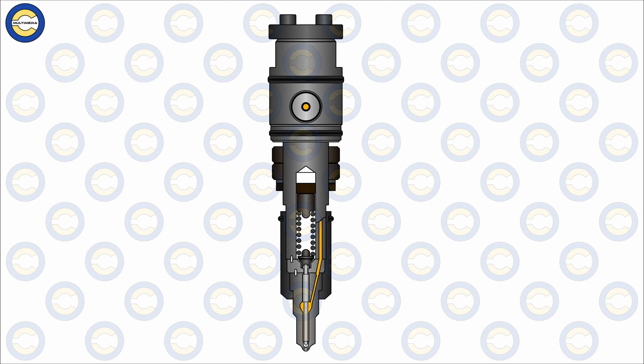With the needle closed, no fuel drips into the combustion chamber or cylinder space until proper pressure build-up is guaranteed and until the fuel reaches the desired pressure. This also simplifies the process of pressure build-up with the help of the fuel pump through restriction in the flow passage. This is how we ensure that the fuel being sent into the unit is properly pressurized and adequately optimized by passing through the nozzle holes.